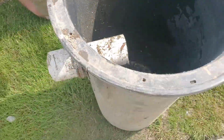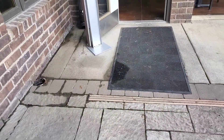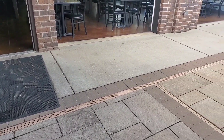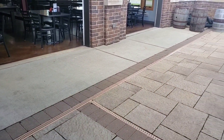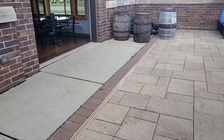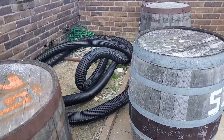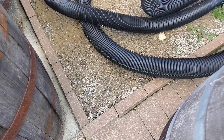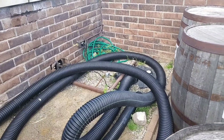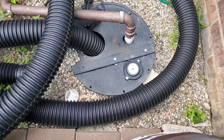So we replaced this indoor sump pump basin with an outdoor system. Here it is when that 2-inch microdrain was in — you can see it running across. When it couldn't keep up with the rain and that indoor sump pump pit couldn't take in any more water, it would flood the inside of the restaurant. They actually have some corrugated pipe that they were laying across the patio to connect to a downspout because that system has been overwhelmed as well.